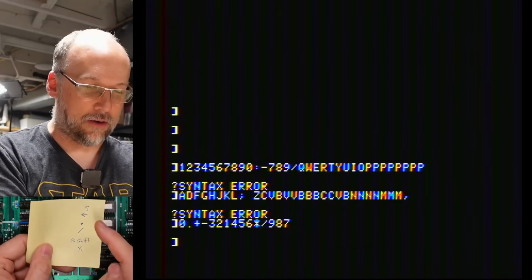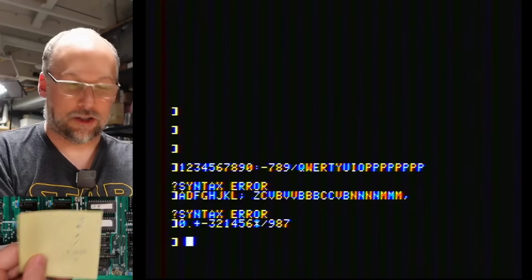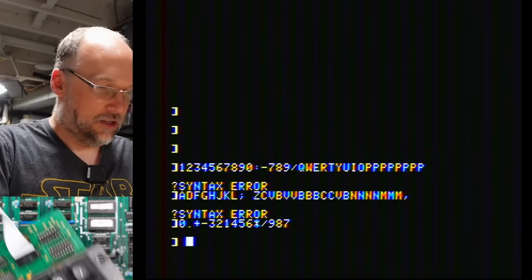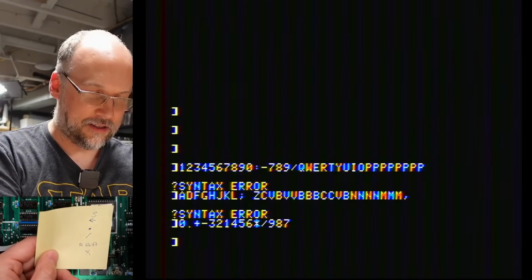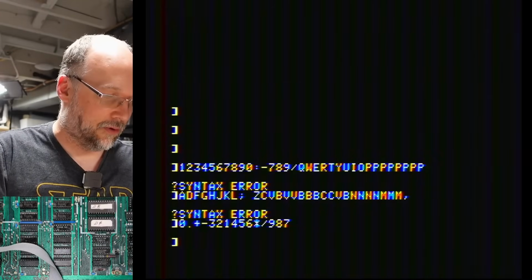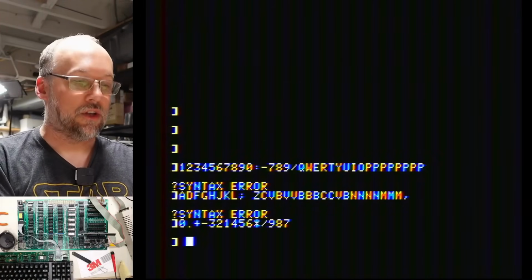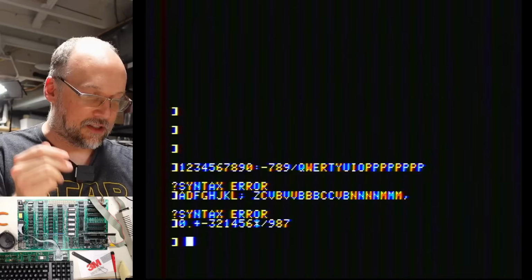Now, I'm not surprised about the back arrow, period, slash, or right shift, because that's where all that rust was on this keyboard here. See all this rust right here? So I'm not surprised that stuff is problematic. But the S and the X, that's on the other side of the board where there's rust over there too, to be honest. So who knows what's happened to this keyboard. Now, luckily, the key switches on this thing are Alps SKCC switches, which are rebuildable, and I think I have some spare parts and stuff like that. So I should be able to get this keyboard working.